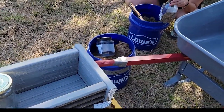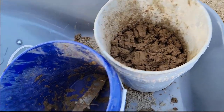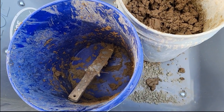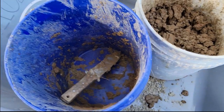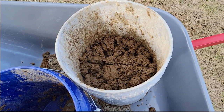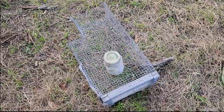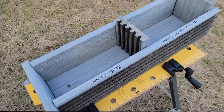I've mixed the dirt — it's all rough cut. I used glass jars and decided to mix the two together: the southeast corner and the southwest corner. I added a smidgen too much water, so it's all estimated, but I think it's close to 90% dirt and 10% concrete. It wasn't run through a sieve — I did have a little cage I ran it through to separate out some of the big stuff, but it wasn't as fine as I'd like. We'll make a couple of bricks, let them sit, and see how it works.